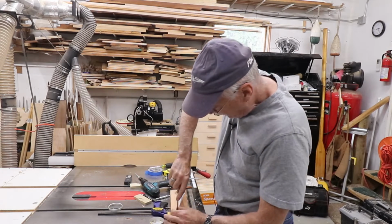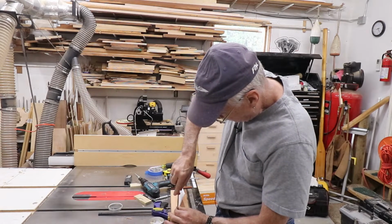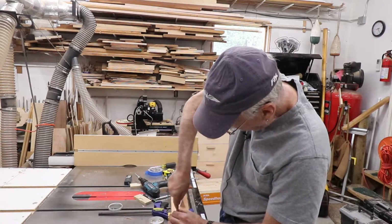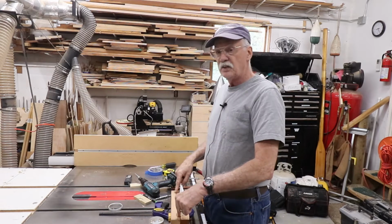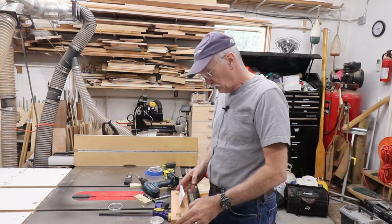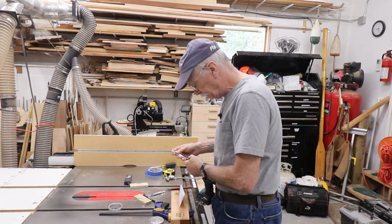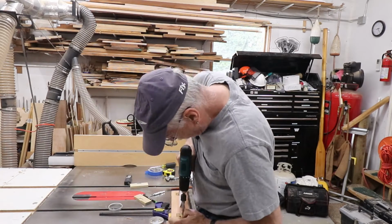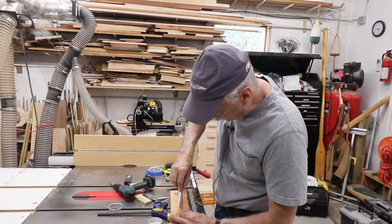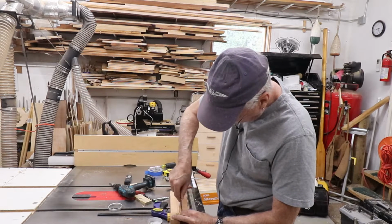Of course, when I get these in and everything's fine, I take it all apart and do the finish work on the box and then hand it back to Jamie. I haven't used a straight screwdriver in a long time for things like this. The reason for doing one side first is that it affixes the hinge in one place. It's not going to shift around when I do the next set of holes on the other side of the hinge. Of course, the way this is set up, I can't clock the screws because they're going to wind up where they wind up. Not much I can do about that.